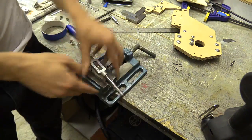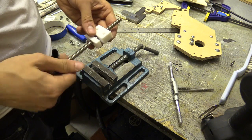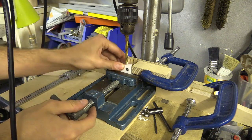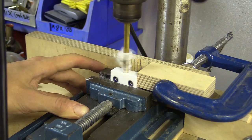The tap worked pretty well, although the teeth did tear the PTFE a little. Considering I've just made this by hand, and more importantly the movement on the lead screw is really smooth, I'm happy to drill and tap the remaining blocks.